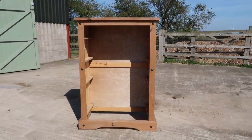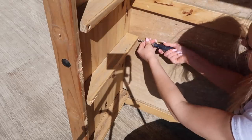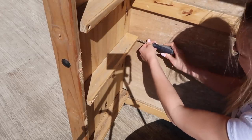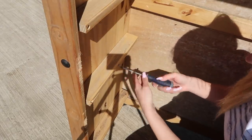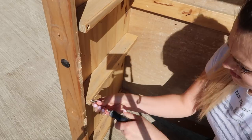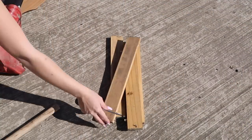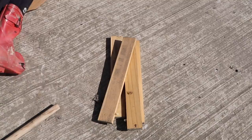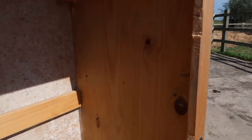So this is what it looked like once they had all been removed, and you can now sort of get an idea of what it's going to look like — more of a wardrobe. Then I removed the pieces of wood that the drawers had rested on. These were really awkwardly screwed in, so it took me a few attempts. I decided to actually leave the top section because this is where I was going to balance the pole on, but the rest of them came out. Now I've taken out all the sections that were down the sides, so I'm going to measure for my pole.